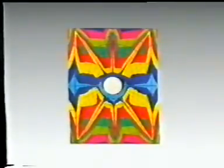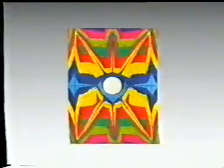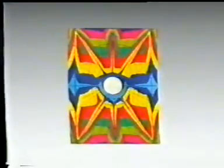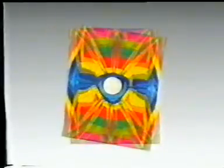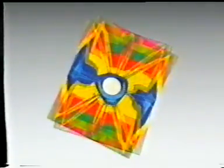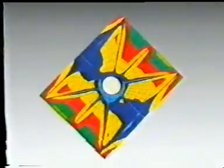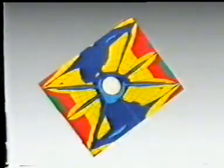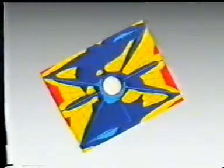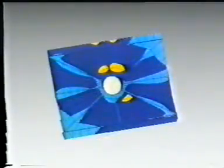In the closed, moveable position, the stress distribution is symmetrical with high stresses in the upper and lower flange, and low stresses in the neighbourhood of the trunnion bore. The stiffeners reduce the stress locally. During rotation, the bending moment and shear force diminish and the axial force develops. At an angle of opening of about 50 degrees, symmetry in the stress distribution is lost. In the vertical position, bending moments and shear forces are missing, and again a symmetrical stress distribution occurs, but now with a low overall stress level.